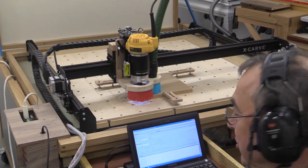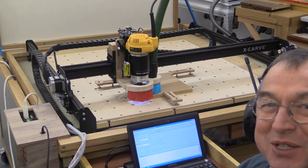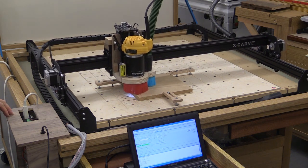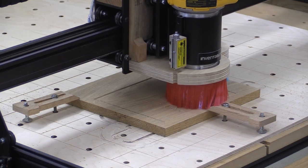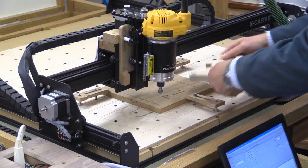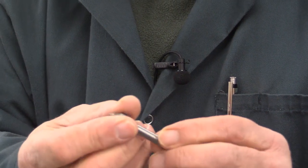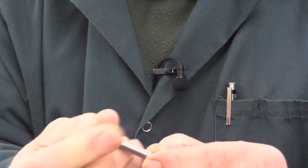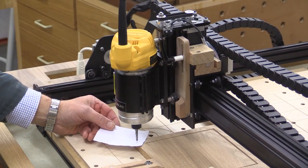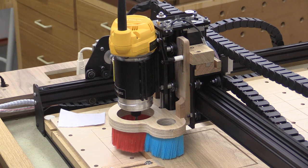I'm going to do a nameplate. I'm going to be using the 90-degree V-cutter and also the 1/8-inch conical cutter, and I think you'll be surprised by what comes out. I've just taken this 90-degree V-cutter out and it's literally only been stopped for less than a minute, and it's quite cool — it's not overheating. So the parameters I set for that I'm quite happy with. I've now put the 1/8-inch conical cutter in — that's in place, so I'm ready to load my file and do my cut.